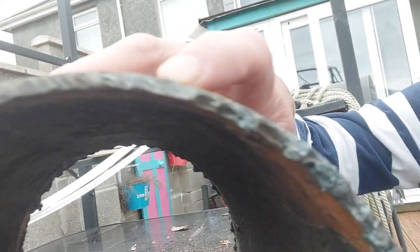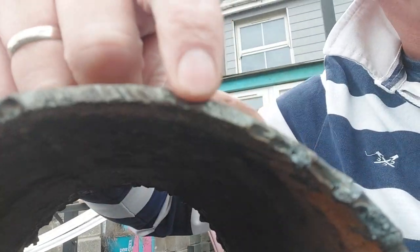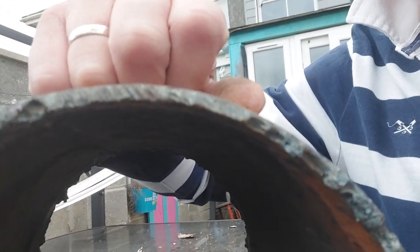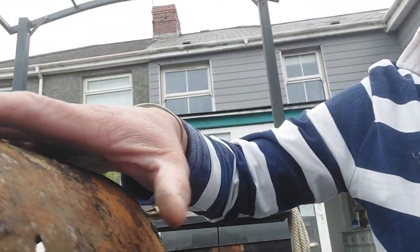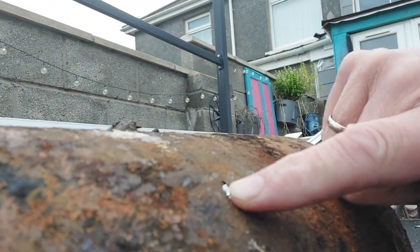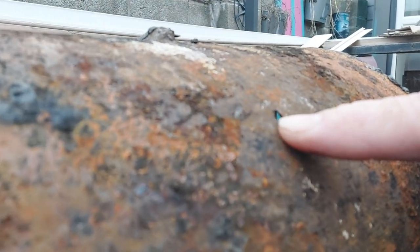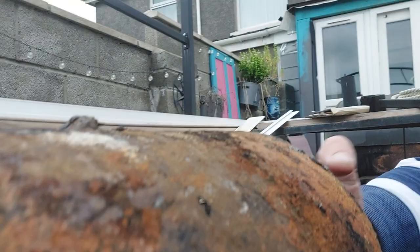Here's an end section so you can see the end there. This tube is only about five mil thick. I think that's a bit thin from new — some firms would probably disagree with me — but I just look at it and think, why have a five mil tube? You could have a lot thicker than this, and also make it accessible to actually protect it. Protection is really important. From the outside, the tube where I hit it here with a hammer has started failing, and that tiny little hole there has gone right through the five mil tube in what is only about ten years.